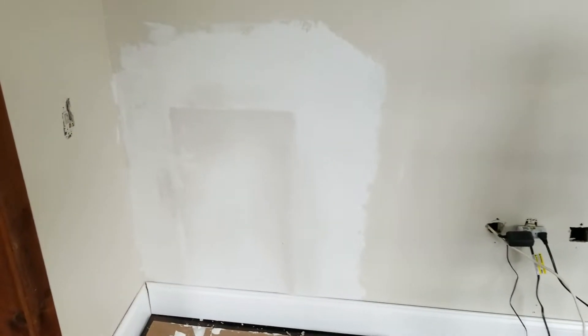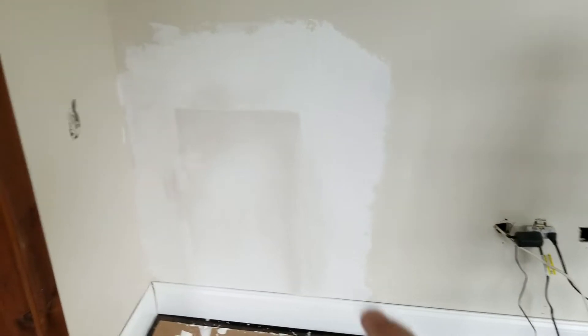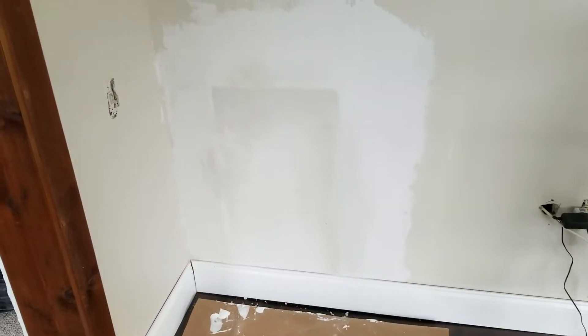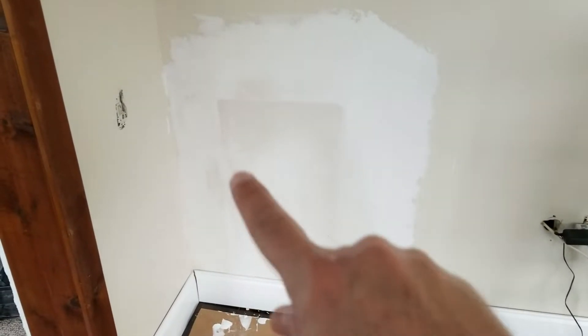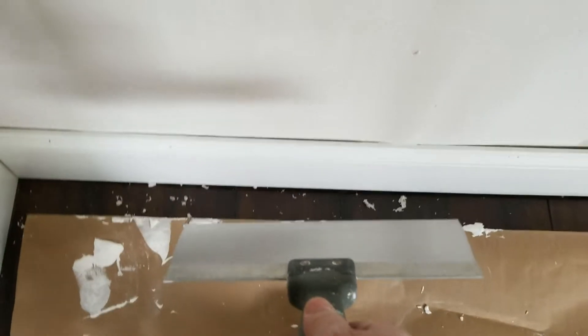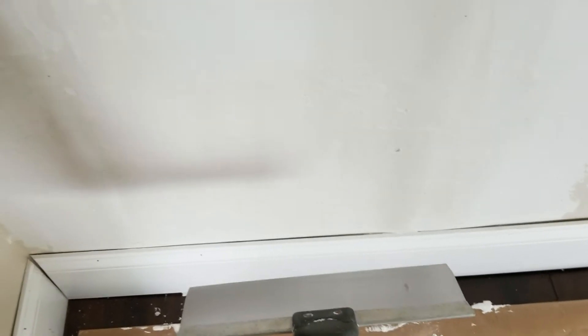Here's what it looks like now the next day — we've let it dry overnight. You can see there's still a little bit of dark areas on there that are still not quite dry yet. We're going to go ahead and sand around the edges to get everything as flat as possible. I want to show you what happens when you end up with situations where the levels are different. If you look at the nine inch taping knife there, see there's a little space? That's what we're going to fill in — you can see how it's sort of convex right in that little area going up there, so we're going to fill all that in and tape it upward like this.